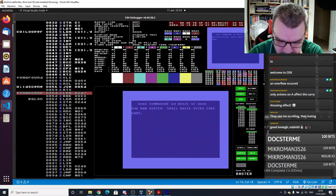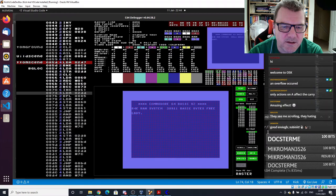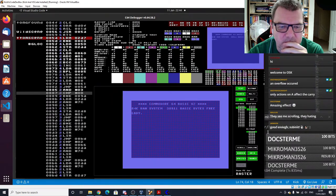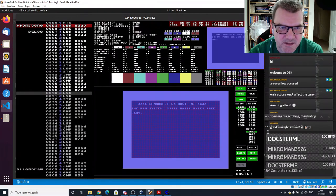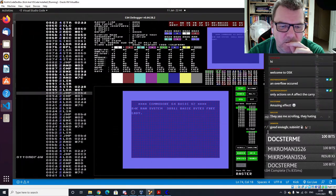Okay. So, load 04, store it away, add one, store it. Right, now we've skipped it. Right, I'm happy now. So we load it, is it plus? Yes it is, good. And it with 03, is it 0? Yes it is, right. And it with 7C. Divide by 2, yeah, 6, store it in 8. So we've set it to 6. Load 01.